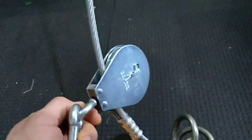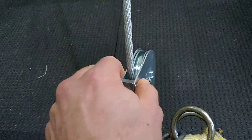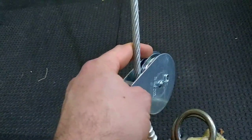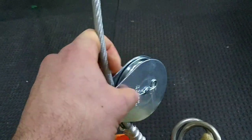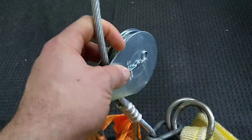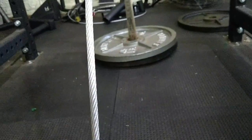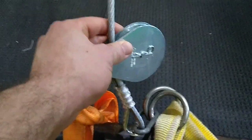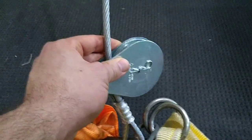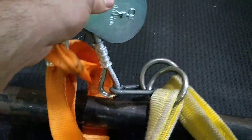That's connected to a swivel block here. Stupid mistake: the swivel block I chose is a quarter inch — it's made for a quarter inch cable. But this cable is covered in vinyl, so it's technically more than that. While it does technically work, you get extra drag. It's not real noticeable until you start getting heavy weight, then it gets noticeable real quick. For my next build, I'm getting the right size swivel block — the next one up from a quarter inch — again from erigging.com. I highly recommend getting one with a removable pin.